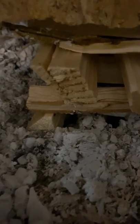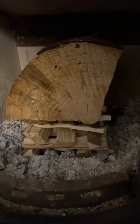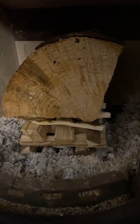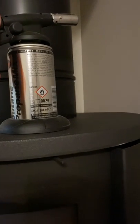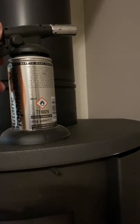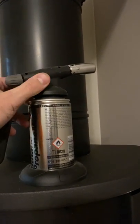For lighting the stove, I've got my kindling stack here. You can see the air vents underneath for the riddling grate are open, and I've got a fire lighter buried in there. I've gone with the log-on-top method, but if you want to be extra safe you can do the top-down burn method, which is where you have two logs on the bottom and then bridge your kindling over them. The ash pan air control is fully open and pulled out a few millimetres to make it start a little bit faster, and the top air control is fully open.